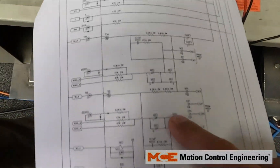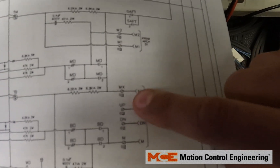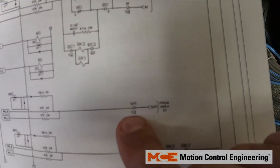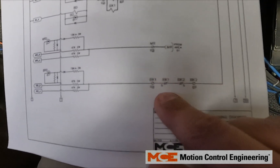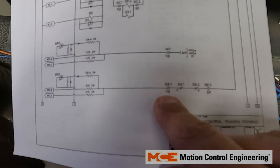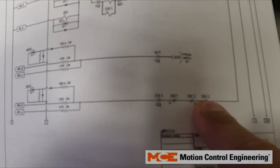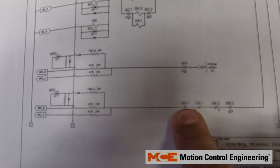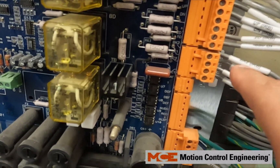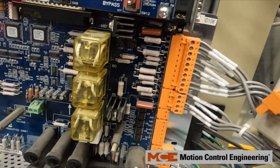Here are your proofing circuits for motor M1 and M2. Down here is BK1 and BK2 — those are the auxiliaries. You'll have two bus feeding BK2, and they're normally closed, so you should always have voltage at idle at BK1. BK1 will be located right here on your IRB board.